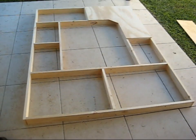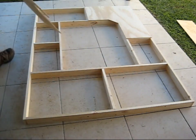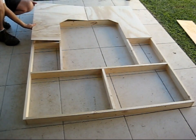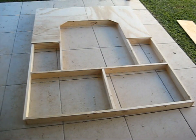So I've cut out all the pieces of plywood top. I'm using a 7mm thick ply. It's pretty thin but it keeps the table lightweight. The frame gaps are quite close together so the 7mm will span quite easily and still give me quite a lot of rigidity there.